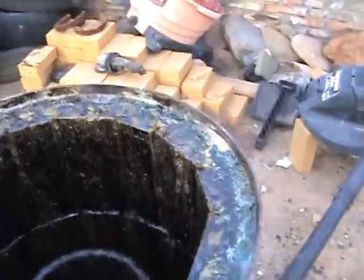So after six pours we have gotten two bars. The first bar we yielded just out of luck because we used the right mixture and decided to use an ore we were familiar with. The other ones were new ores. The second ore was high concentrate of black sand magnetic — I don't think I got it hot enough, and it was also the wrong type of flux.